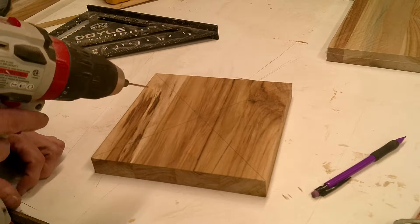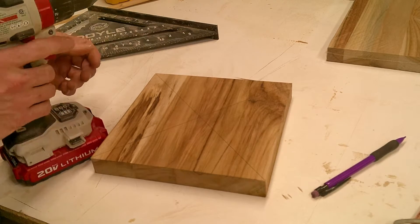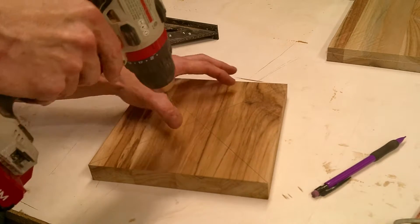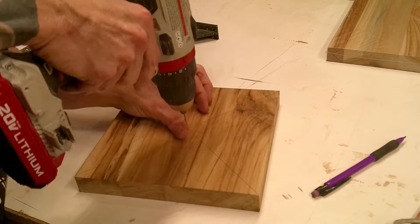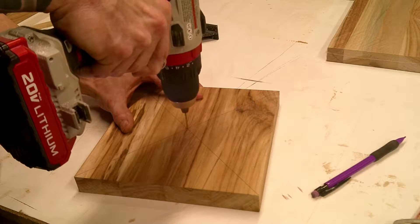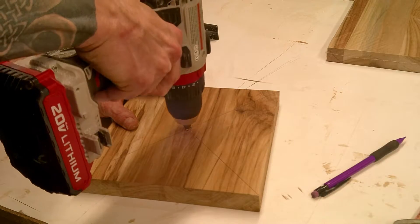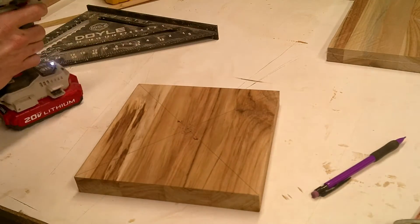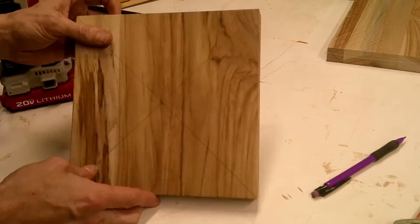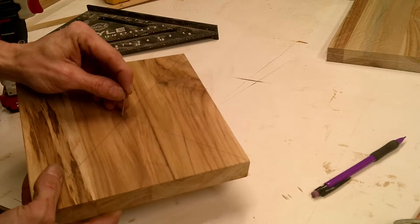But for today's video I'm showing you how to do it with just your drill and the table saw sled. So let's go ahead and do this one — I'm going to find our center point, make sure we're straight up and down. Now that we've got our hole drilled, we make sure it went all the way through and that our nail fits in there nice.